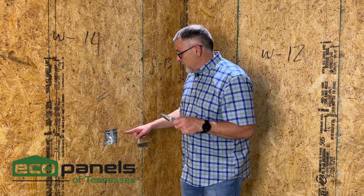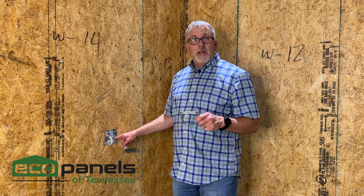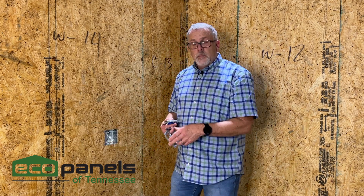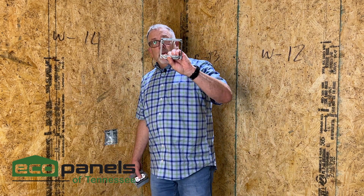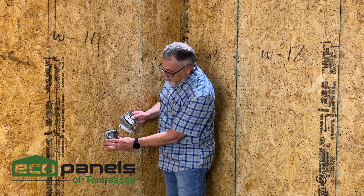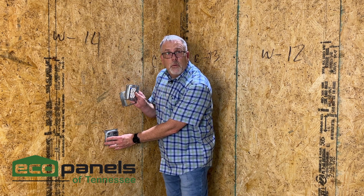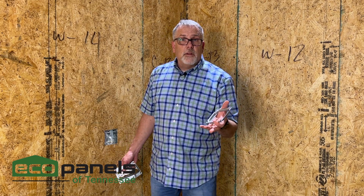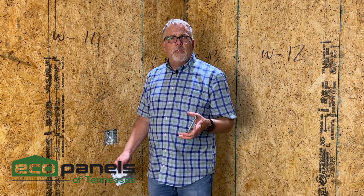The great thing is we're putting in this four-inch box at every outlet point. You can buy the single cover which gives you a single standard outlet, but you can also buy the double cover — which when you install it gives you two outlets, four plugs total. That's really useful in an area where you have a lot of things to plug in, like behind the TV or by your desk in your office, where there never seems to be enough plugs.